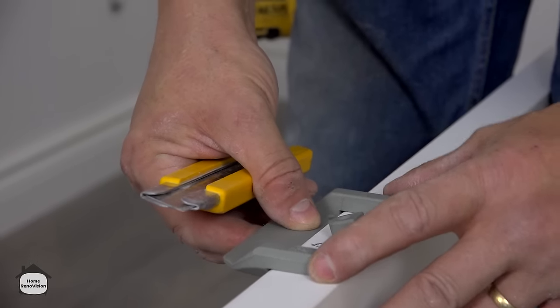Be careful because this device has little ridges that collapse under compression when you force it down. Make sure those ridges are going left and right toward where all the meat of the door is. If you go to the front and back, they might be drilled too close and you'll cause the door to split.